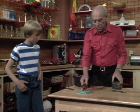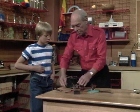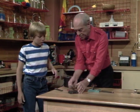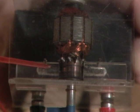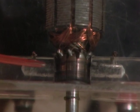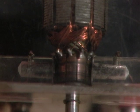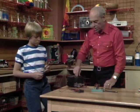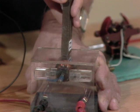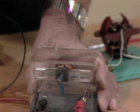Now see if you can find the important parts of a motor right here. This is from an actual real motor, but I took it apart so you could see the important parts. Where is the spinning magnet? Those ones right down here. And there's the coil for the electromagnet. Here's the commutator. See that little black thing right there? That's a carbon brush, a hunk of carbon. Current can come up here and the carbon touches this part. Current can come up on the other side and touch that one over there — that's how the current is reversed as this spins. What's missing? The stationary magnet. There's one right there. I'll turn on the current — you hold the magnet up above. You can feel the electricity! Will it work on the south side? Try it — it goes the other way. Sure.